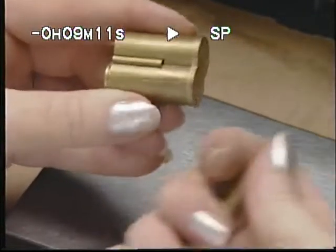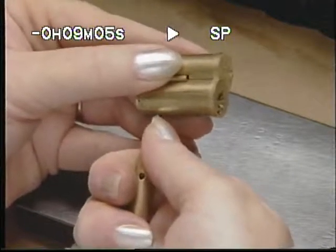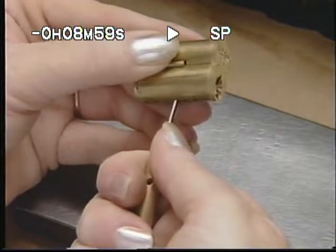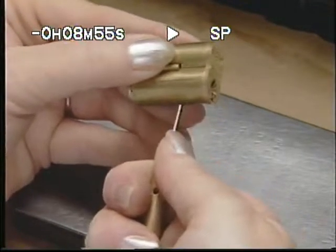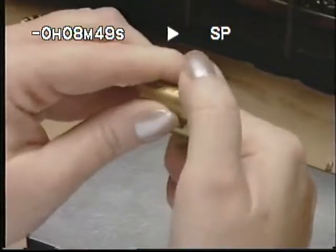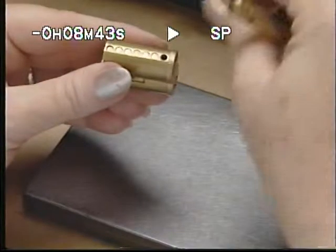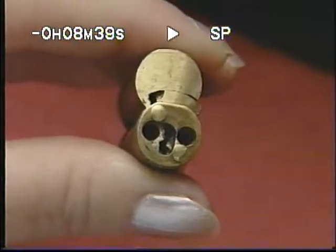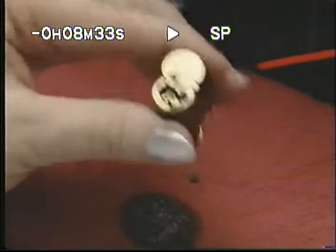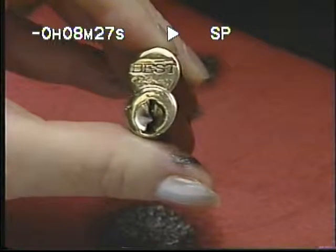You can also use the thumb check method to check if the stack height in each barrel is consistent. Do this by simply placing your thumb firmly on the ejector pin, referencing the depth of the first barrel, and then check each barrel against each other. Any missing or additional segments will cause a change of depth. If necessary, eject the pin segments and recombinate each barrel. Eject barrels 4 through 7 first, since these are the positions where your code numbers change. It could be that there is some foreign material in the core; use LPS lubricant to flush the material out. Again, when the LPS lubricant is dry, re-lubricate the core with graphite.